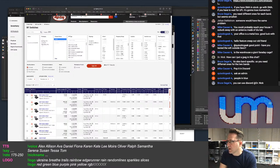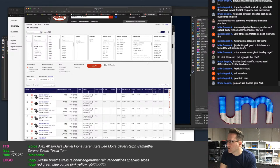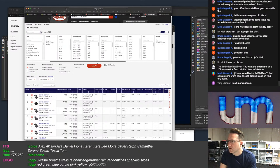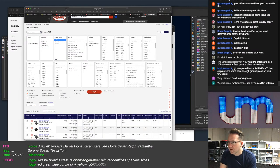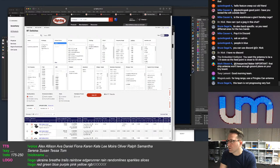Frequency range. It's going to have to be a wide band switch. And it's going to have to be... Well, let's go the other way around. Where's my button type? Oh, I was on Mouser. So this doesn't give me the option to choose the switch type, which is really frustrating. Oh no, there it is. Okay, yes. So I need single pole, double throw.